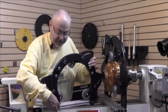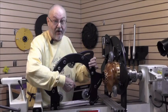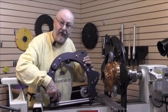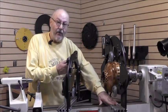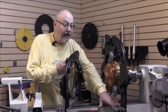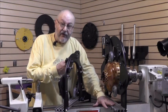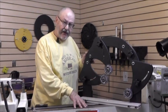The mounting holes on the back are sized at six inches on center — six inches radius gives us a 12-inch diameter lathe. There are two extra holes up one inch: if you use those upper holes, it's five inches on center, fitting a 10-inch lathe. The 16-inch model has a second row of holes to fit a 14-inch lathe. On the 20-inch model, using the upper row fits an 18-inch lathe like the Laguna, Grizzly, and new Jet 18.